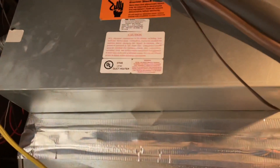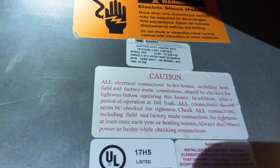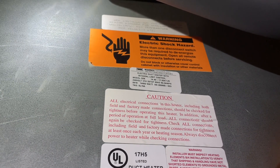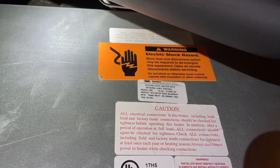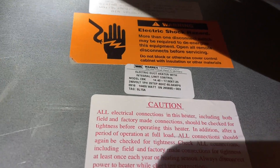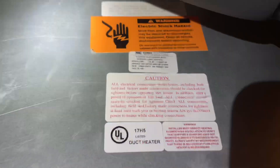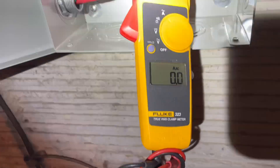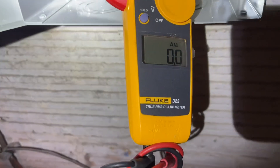We got the new blower motor in — fully operational. We have air movement now. I'll be very blunt and honest: I know very little about electric heat strips, because I usually don't work with ducted heat pumps. Ductless mini splits, no problem — but in regards to this, I'm clueless. I just don't have the proper training on it. So right now I'm going to check for amperage to see if it's actually pulling power, because I hear some relays opening and closing over there. Right now it's not pulling any power with one leg.